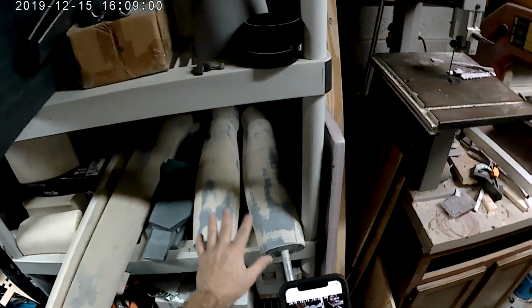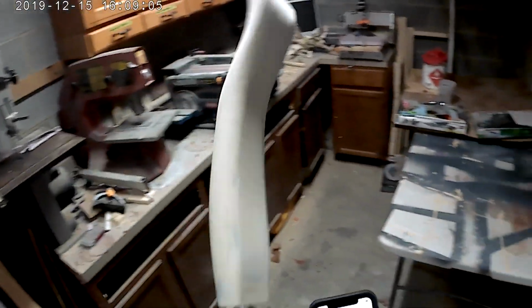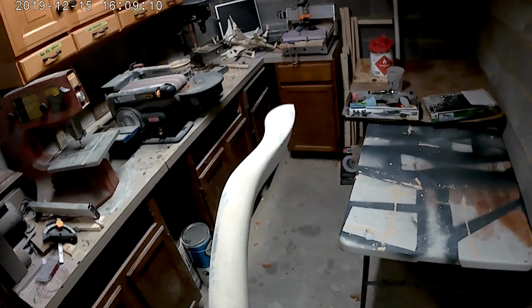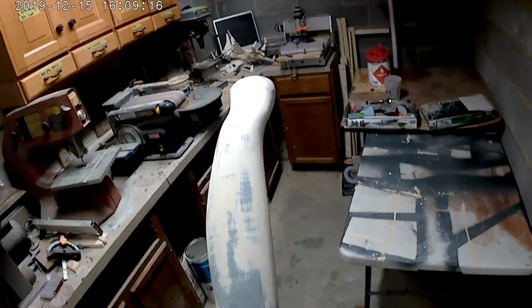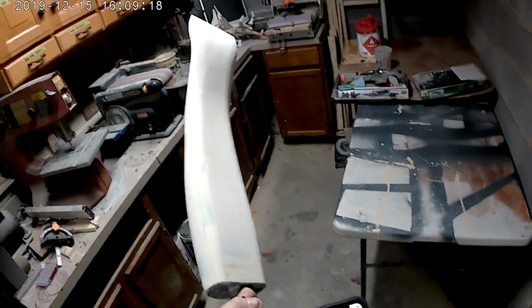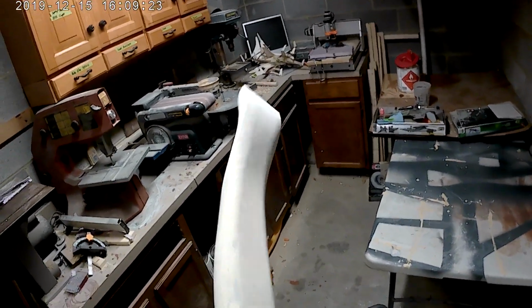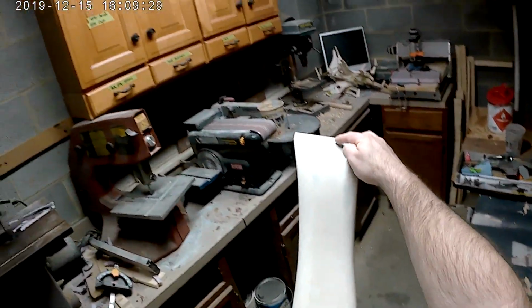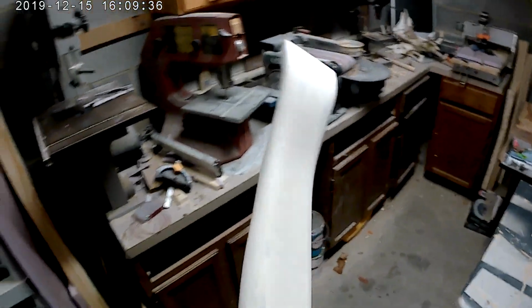But here you can see I've got inlet duct plugs with aluminum tubes to hold them, so when you go to do it, it'll be nice and easy. All my ductwork, I believe I'm going to use fiberglass and carbon fiber sleeving and heat shrink to make, which should make making these extremely quick and easy. Just a matter of sliding it over, wet it out, heat shrink it all down until it goes green, take the heat shrink off, and then just run a knife blade right down the center of it to cut it, and then peel it away, and then just re-seam it back together.